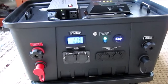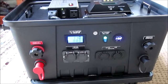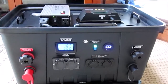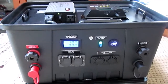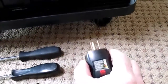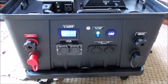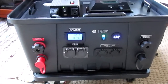Many who've posted have inquired about how this system is grounded. It is not actually grounded, but it does have a neutral-ground bond. Just as a forewarning, I'm not an electrician, so please do your own research or consult with a professional to ensure your safe use of a portable generator system like this. My understanding is that a neutral-to-ground bond improves the safe use of inverters and portable generators that are not actually earth grounded.